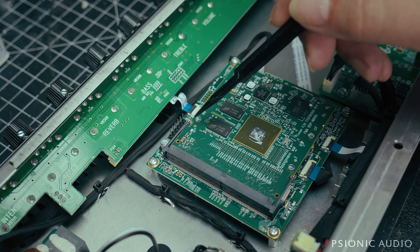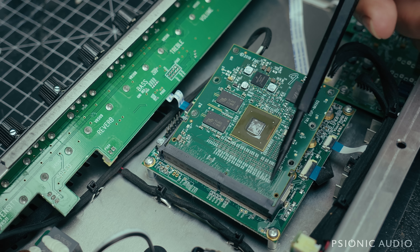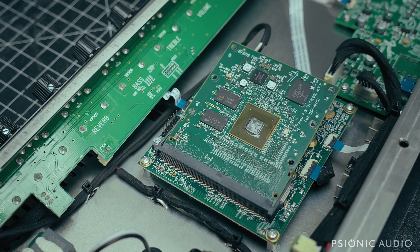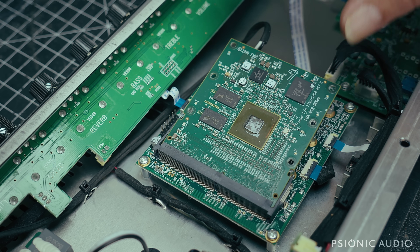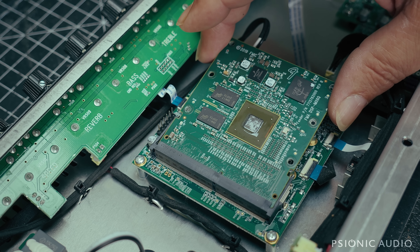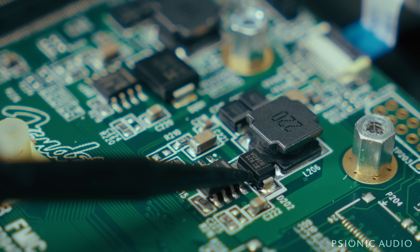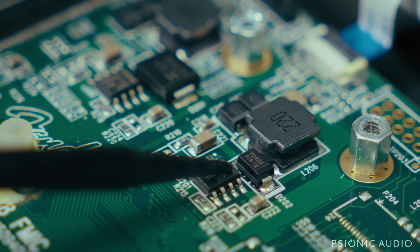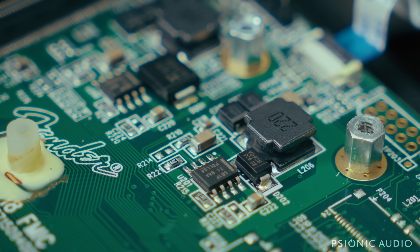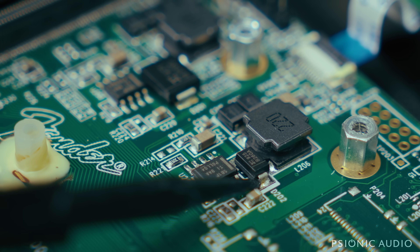Here's the little chip. I'm going to show you the proper way to do this — if you don't have the right tool, you want to open these up with a very small, delicate plastic or wood thing. You don't want to use any metal because you could chip away at the chip and do a lot of damage. Make sure you don't have any static on you — I'm touching something grounded with my left hand and just pull it to the side. And once that was all out of the way, I found this slightly discolored diode — it's D202. When I measured it with a meter, it is no longer a diode; it has failed open. That's exactly the part that both Brad and Howard kindly pointed me to. Thanks guys.